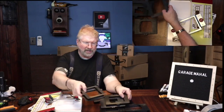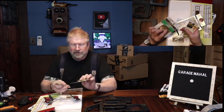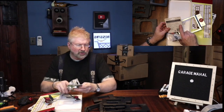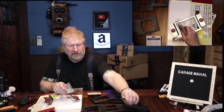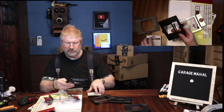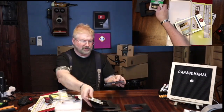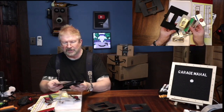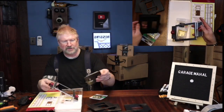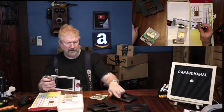So that was like your larger door hinge. I'm going to be using something a little bit smaller. So I'm going to be using two different size things. I have a latch strike — this is two and a quarter. So you're going to look for the two-and-a-quarter latch. This is going to be the two-and-a-quarter latch plate template right here, so that's what we're going to be using for that.